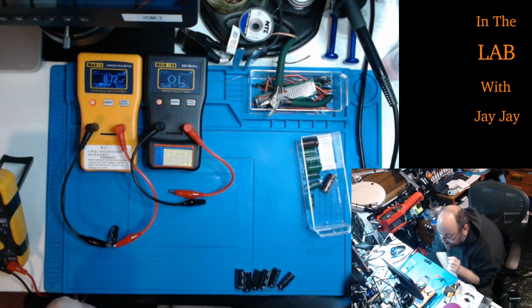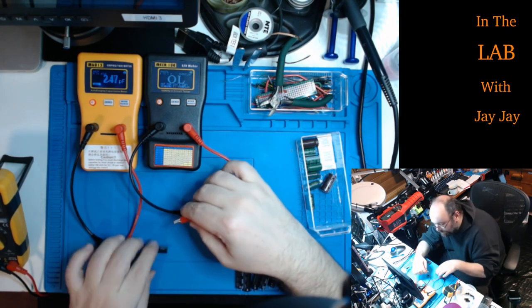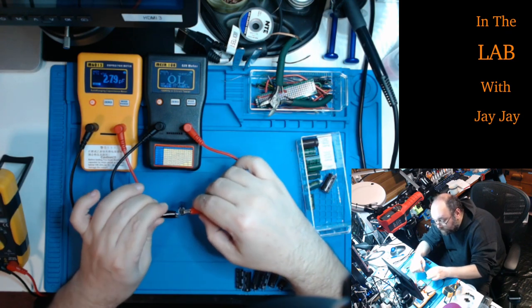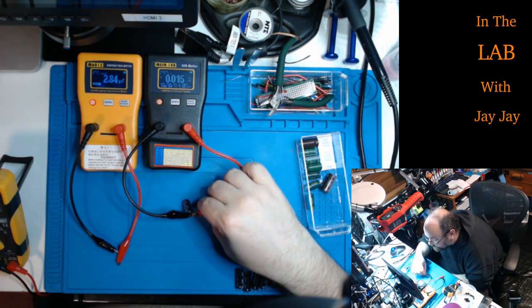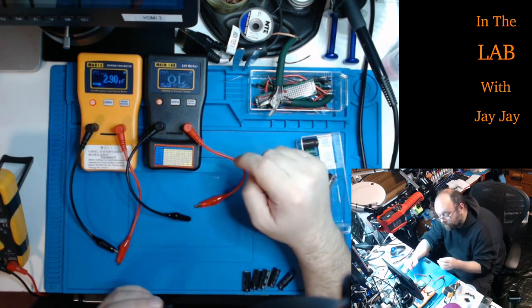This guy. Oh, look at that. He doesn't register much capacitance at all. And the ESR. So you really do need both readings, because you can get ESR looks fine and the capacitance is shot. You can probably have it the other way, where the capacitance is fine and the ESR is shot.